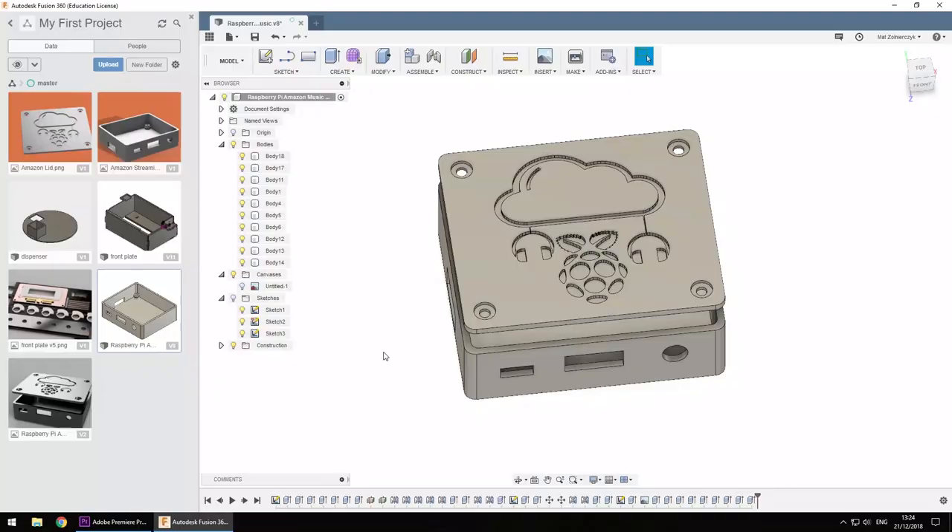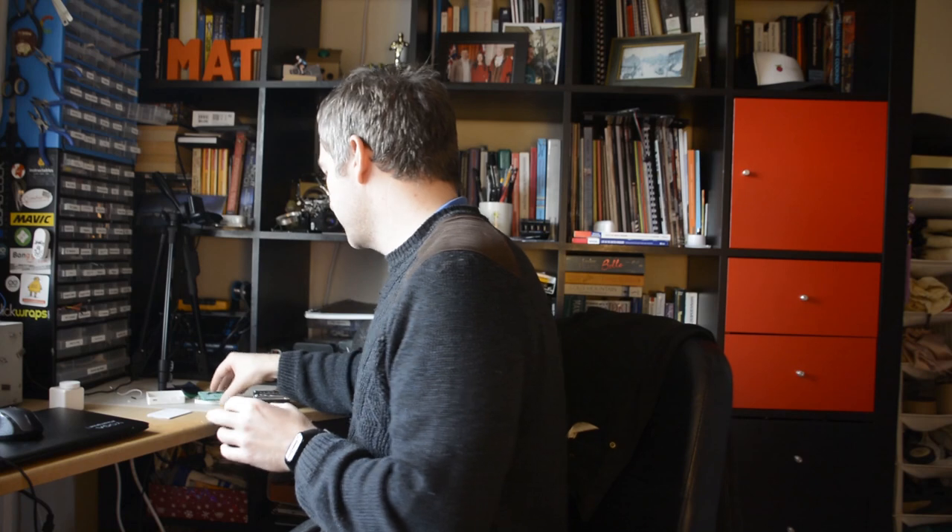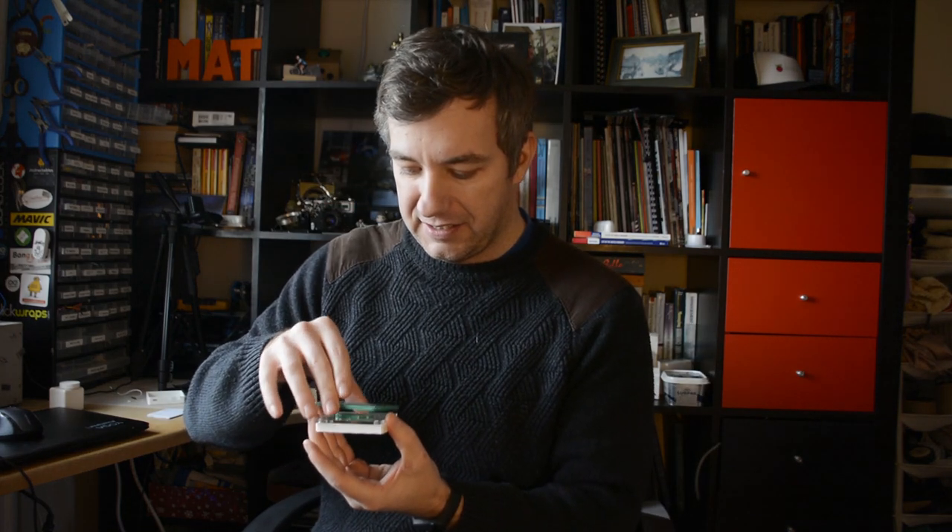Plex works with it greatly. It wasn't without some problems though, and a couple of problems I encountered happened straight away as I was designing the case. As you can see, I've got a first design in my hands. Even though it's cut properly and looks really nice, there's a massive problem — it's much smaller than the original board. Why? Because I didn't have my board at hand to check the sizes, and I trusted a write-up online with the dimensions. Unfortunately the dimensions were wrong, so I ended up with a much smaller enclosure than I should have. Always check what you're designing against and verify the design sizes are correct. If you're going to make a mistake, make your own mistake — don't repeat someone else's.